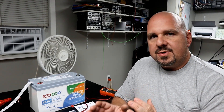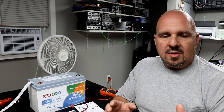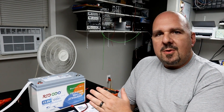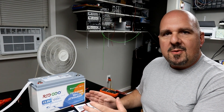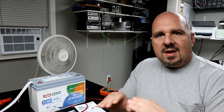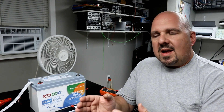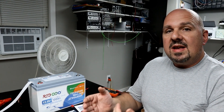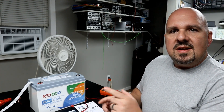That means we are ready to proceed to test number two. This is always my favorite test — the torture test, the runtime test, the longevity test, however you want to word it. What we do is take our lithium battery, hook up a regular trolling motor dropped into a tank of water, connect all kinds of test equipment to the battery, and run it from 100% capacity all the way down until the battery management system cuts off the voltage. We run it from 100 to zero, and when we're done we'll use the data to calculate exactly how many amp hours we got out of the battery. This battery is rated at 100 amp hours, so we should expect to see at least 100 amp hours out of it.